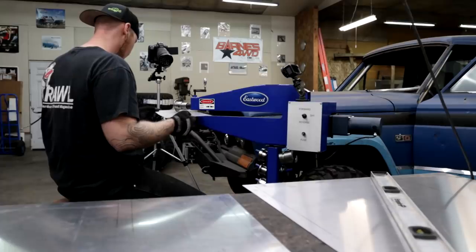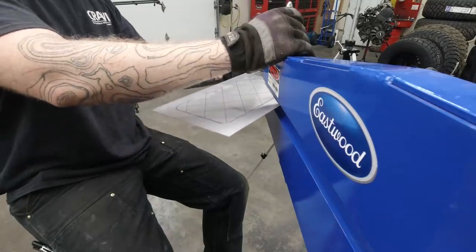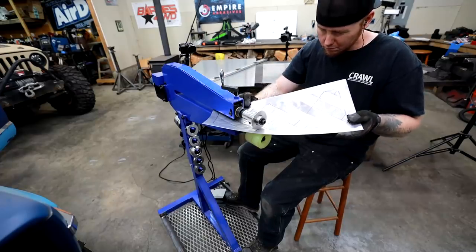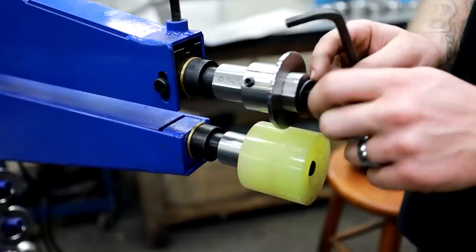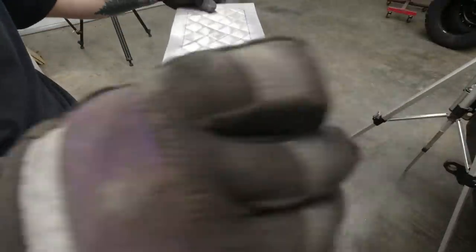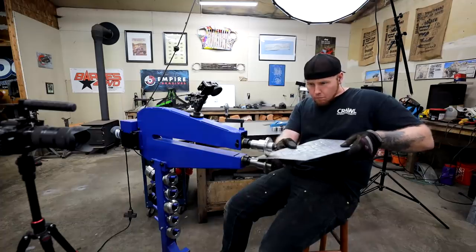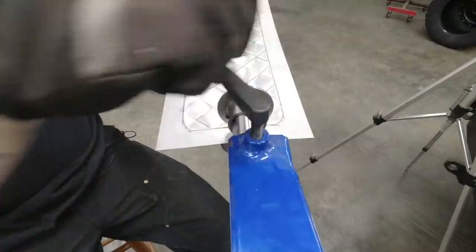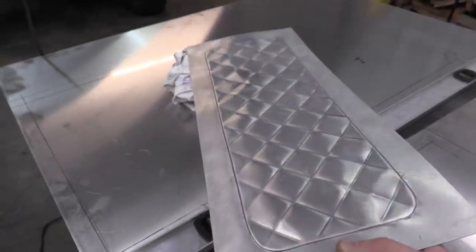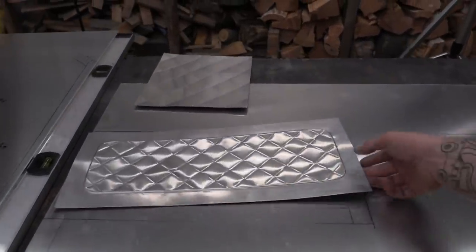Because I don't use a bead roller very often, I'm going to start with a practice panel to rewarm up my skills. I'm starting with a diamond-shaped cross-hatched pattern that I've seen a lot on Instagram and think looks sweet when implemented correctly. The dies I chose are a knife edge upper forming die and what people in the industry call a roller skate wheel lower die — it's a round piece of polyurethane with a little bit of give. To finish off the cross-hatched pattern I'm using a set of offset dies to give it a really nice step all the way around. I've been experimenting, gaining confidence with the machine, and I think whenever I do the real piece I can make it look halfway decent.